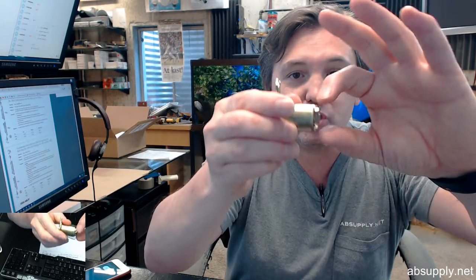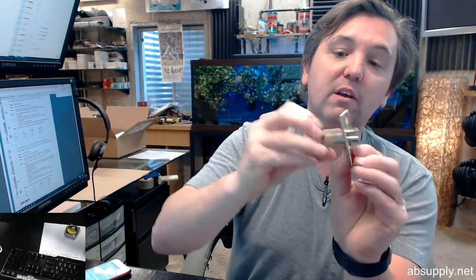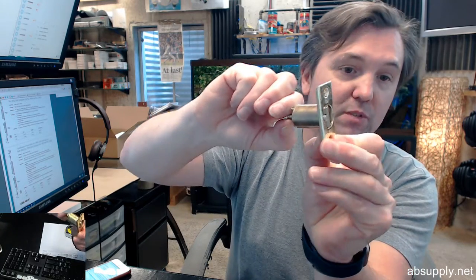Sometimes you need to pinch these two shoulders down a little bit to get it to slide onto the chassis. Sometimes, of course, you'll need to grind the tip of this down a little bit because as you rotate the knob or the lever, it will not actually draw the latch fully flush and back to the unit. Sometimes it'll only come that far. But at the end of the day, if you can make those adjustments, or if you have a generic imported lock, or even a domestically manufactured grade 2 cylindrical lock, it's possible this very inexpensive latch bolt will fit. I've done it countless times in that scenario.